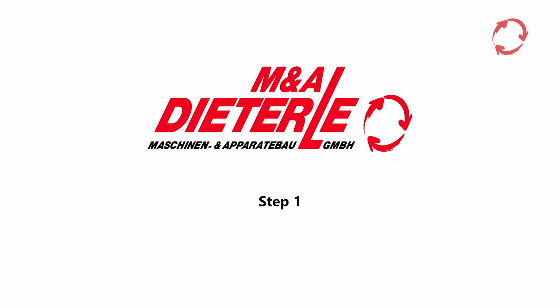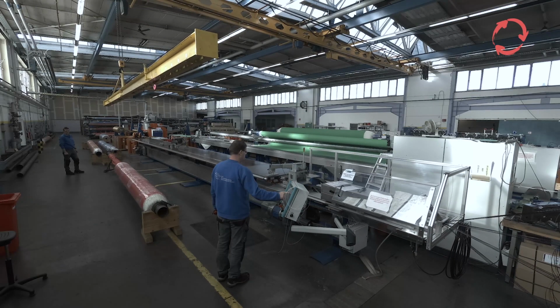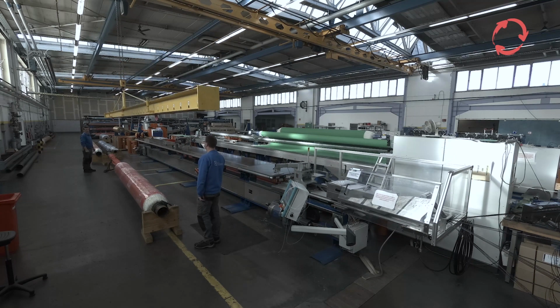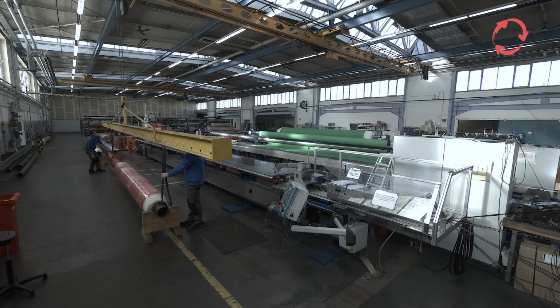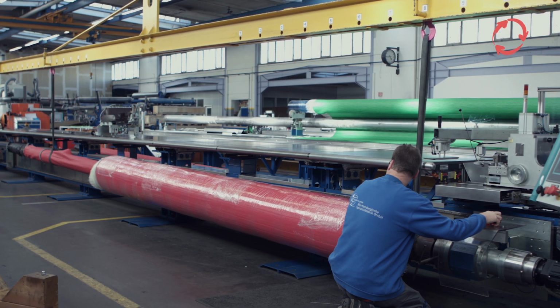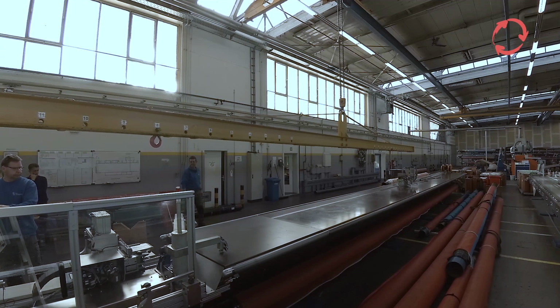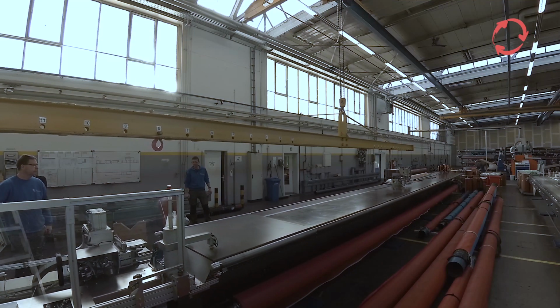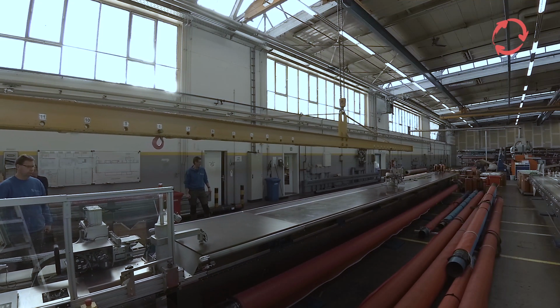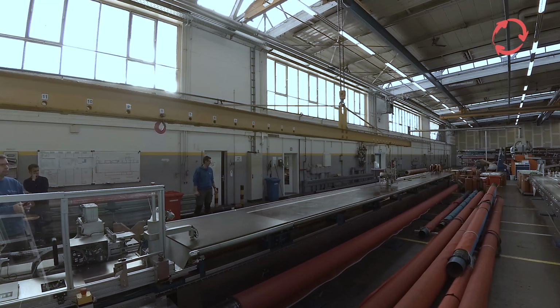The entire setup process for sieve filling is carried out in the steps described below. The table module is moved to the rear to allow for unobstructed insertion of the unfilled sieve roller. Insert the sieve roller into the jaw chuck on the operator side. The table module is then moved forward to make the rear bearing units accessible from above for the second winding tube. The second tube, with a precursor, is inserted like the front one.